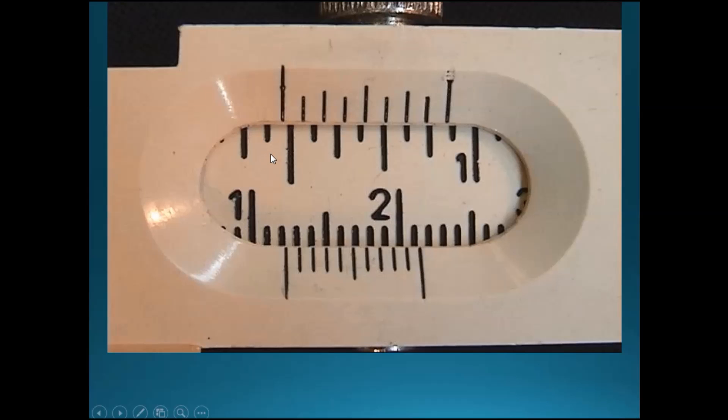Let's take a look at an example of a vernier caliper reading. The first reading you need to get is called the macro reading. For the macro reading, you read from the baseline and read to the nearest notch backwards. The nearest notch backwards is the 1 cm mark, and there is a 2 cm mark. Therefore, counting along: 1.0 cm, 1.1 cm, 1.2 cm — the initial macro reading will be 1.2 cm.